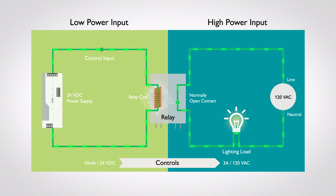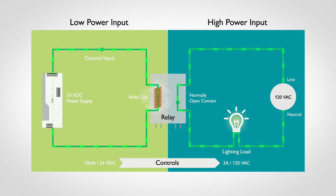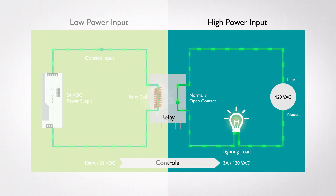The armature has two different states: normally open or normally closed. If it's normally open, it'll close when the relay is energized, which could turn something on. Conversely, if it's normally closed, it'll open when energized, which could turn something off. The armature movement is important because it's what allows current to flow or not flow to either the contact or load side of the relay circuit. The contact side is where you would connect your power source for the load, as well as your end devices, like a light, valve, motor, etc.